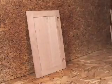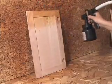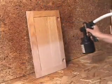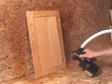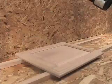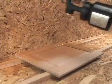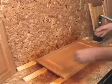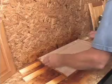You spray a coat on the front and wait for it to dry. Flip the door around, spray the back and wait, and in most cases you still have to come back one more time to touch up the edges. The prop, spray, and wait method leads to other problems too. The cabinet doors have a nasty habit of getting stuck to wood blocks and anything else they come in contact with while they dry.